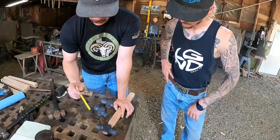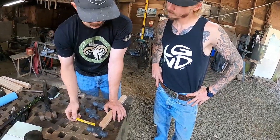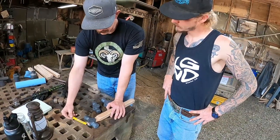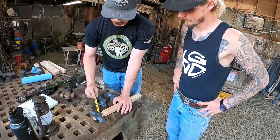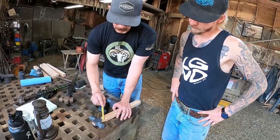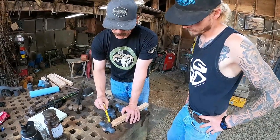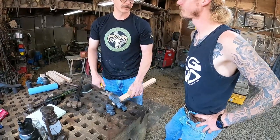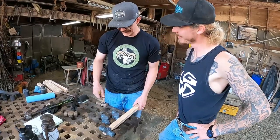And so I try not to go all the way right away when I'm handling a hammer. So I don't put a metal wedge or anything in because I want to leave somewhere for it to go when that hammer starts getting loose later in its life. The guy can drive a metal wedge in. Well, and if I put the swell all the way to the bottom right here, it looks really nice and really finished and fit. But then the guy never has any room for later down the road when he's working to keep tightening up his hammer as it's getting beat up. I have that issue with two of my hammers right now.